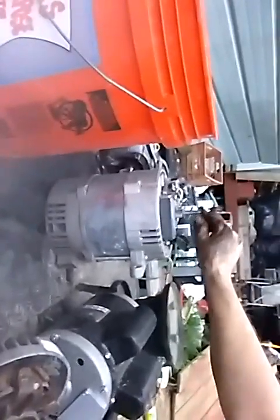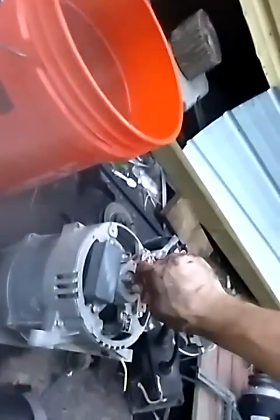I took a small handheld drill and hooked it up to this generator head right here, and it turned it fine — but I only got half the voltage out of it. So just a handheld drill gave me half the power to run my house. Now, if I couldn't charge a 12-volt battery to run that drill to turn this generator, I'd be an idiot. Think about that. I turned this 3,500-watt generator head — I put my own shaft from here into the middle so that this turns and it turns the shaft, and it has coils on it identical to the alternator.